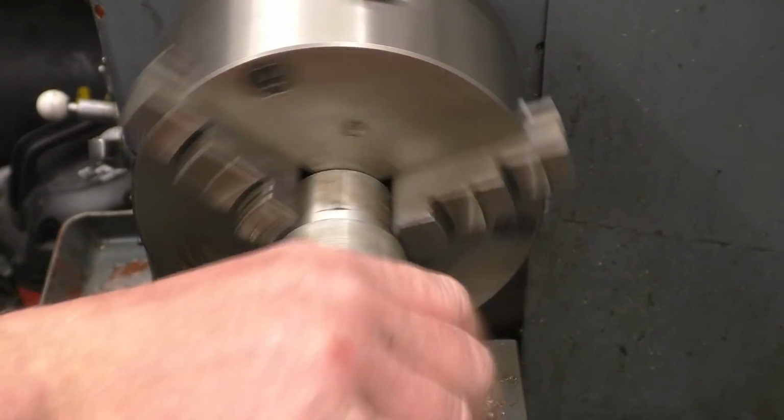I'm going to do this end first. I've got some aluminium bar I can get out of, I'm sure, 50 diameter. The size is not critical. The quarter BSW is the only critical size, and I'll probably put a helicoil in there, because the quarter BSW in aluminium is fairly weak and it will strip eventually.